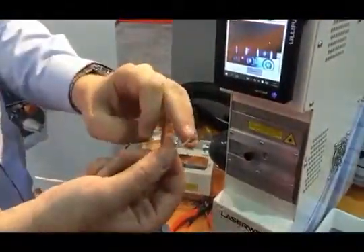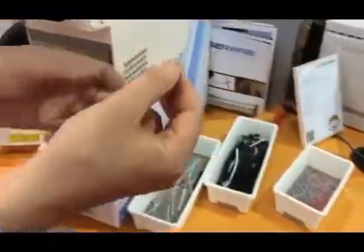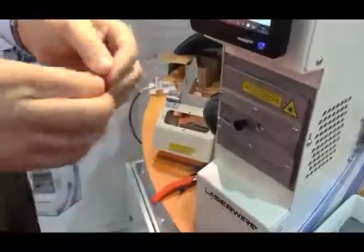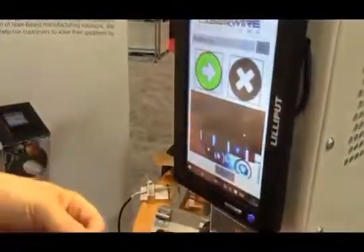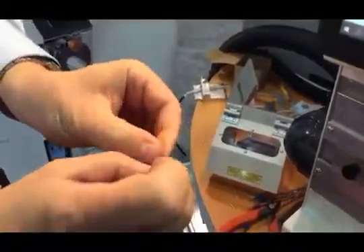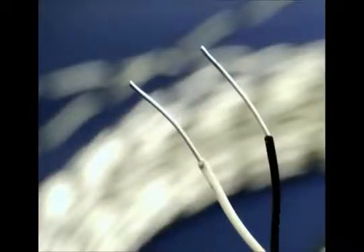What's really nice about fiberglass is it actually seals the ends as well. If you want to run a different wire, say this twisted pair — this is a Teflon coated twisted pair and we're going to strip that without even untwisting it. I click it onto the small aperture, select the recipe set for the twisted wire, pop it in to the backstop, press go, strip to the bottom, strip to the top. Then untwist the wires and we have our stripped twisted pair — we didn't even untwist it first.